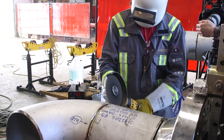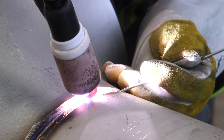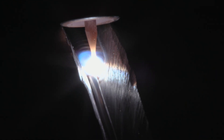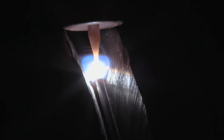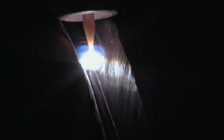If this thing reads say like 30 to 60 parts per million, you'll start getting a light straw color, some yellows. Going up to 60 to 80, you'll get some brown colors, some gold. Past 100 parts per million, you have blues and purples and beyond. If you get a really terrible purge — especially a nickel alloy — beyond 100 parts per million, you'll see little pepper flakes, kind of like a skin floating on the weld puddle. It gets to a point where the oxygen inside the pipe is so bad that your bevels will start dissolving in on itself.